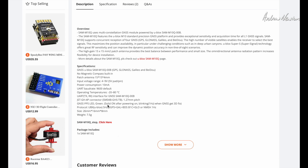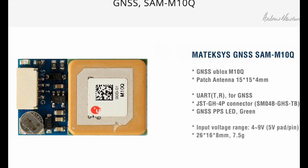The LED is green when it's powered on and starts blinking when it gets a 3D fix. Weight is 7.5 grams, and they even include a 3D print file if you want to mock one up. There's also a setup program called U-Center, but it's Windows only and you usually don't need to change anything — the flight control board takes care of whatever changes it needs to make.